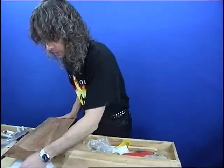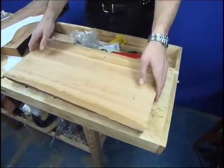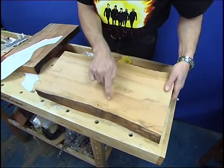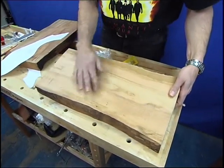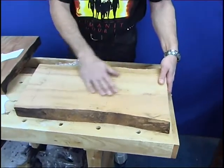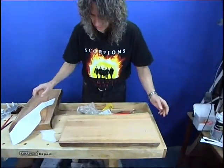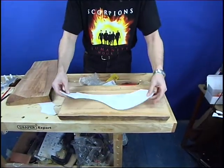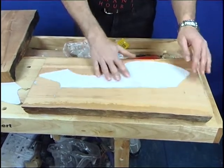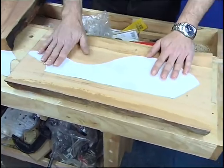If we look at the other piece, which is a much nicer piece of wood, that's pretty clean on both sides — there's nothing there. If we switch that over there's nothing; there's a few little knots or wormholes, we don't know. So we're going to have that as the back, and we'll keep this as the front. We'll place it around here so we get all this nice grain in the body, so let's mark that up.